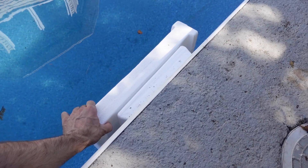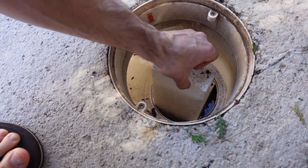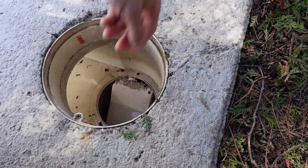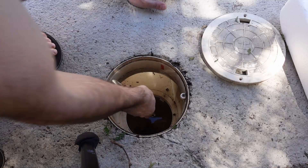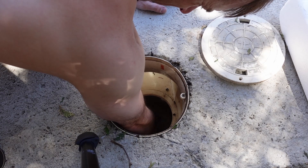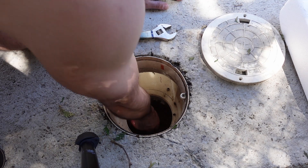Now I'm going to go over to the skimmer and pull out all the styrofoam bits. The skimmer smells very bad — it smells like 50 dead worms sitting in water. These little pieces of styrofoam prevent the skimmer from cracking; as the water expands when it freezes, it crushes the styrofoam instead of pushing outward and breaking the plastic pieces. I grab an adjustable wrench and remove the plug from the skimmer. There are two plugs down there but only one is connected to anything.